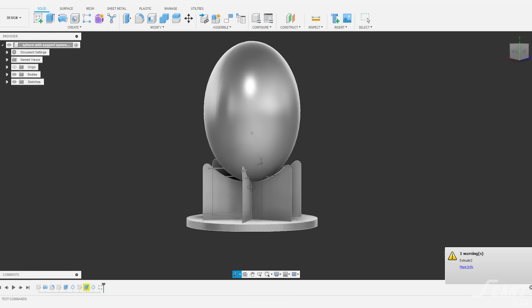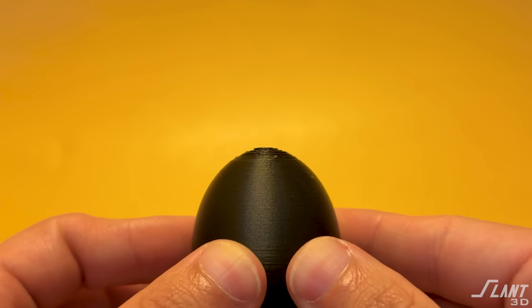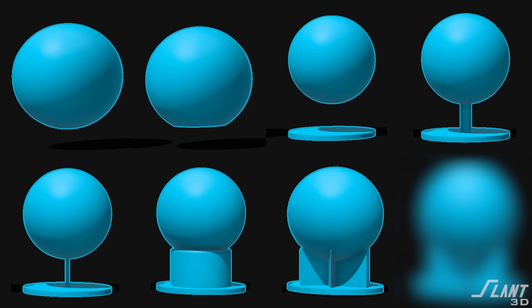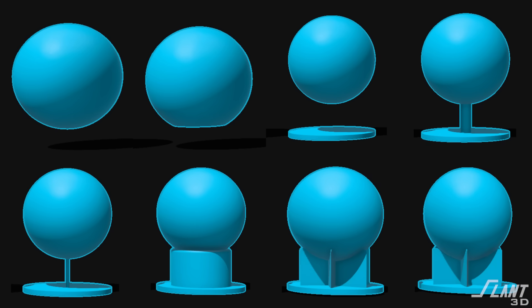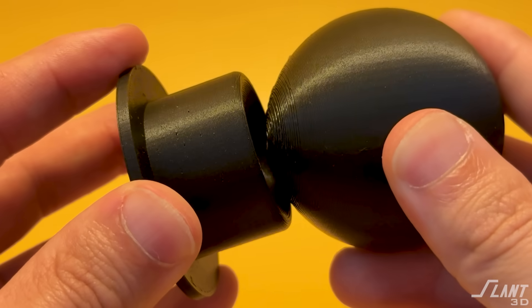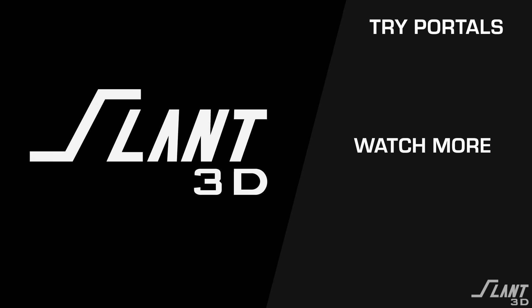Taking it to the extreme, a very tall oval can look pretty crisp, but you still have that initial steep area where one layer is far out from the side. Trying to get a perfect sphere right off the bat is almost impossible without simply flattening the edge. Spheres are just very complicated geometry for 3D printing — the smaller the sphere, the steeper the angles, the higher the overhangs, the more problems you'll have. The tricks covered include designing support, getting spacing right, and using sprues. Hopefully you learned a few ways to make printed spheres crisper. Have a great day, everybody.